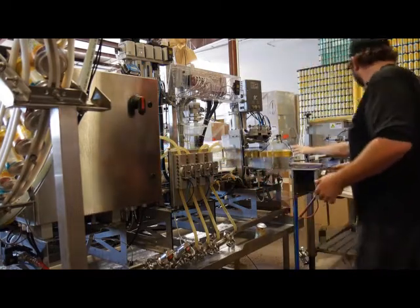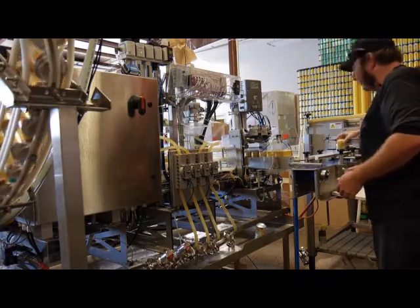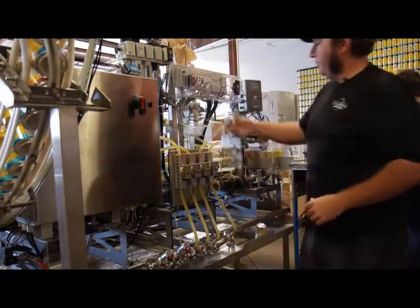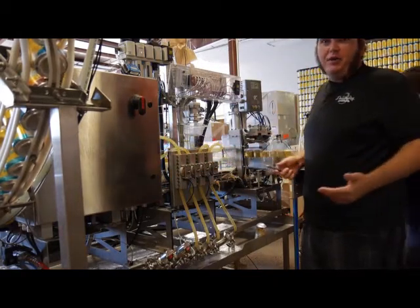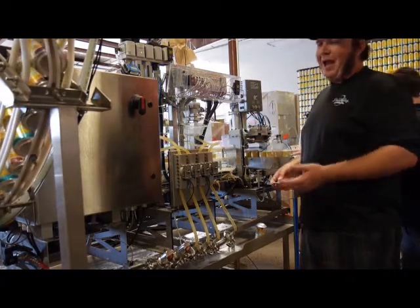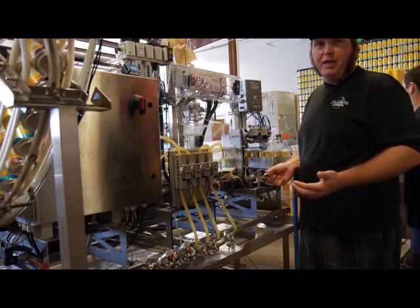How are we looking, Kyle? 360s? We got one that's a little low. So now, Steve, we've got the fills good. He can reduce the delay to how fast the canner can run. We were running about a 5-second delay to get set up, and we'll run about a half-second delay, which will put us up to where our canning maximum is, about 40 to 41 cans a minute.